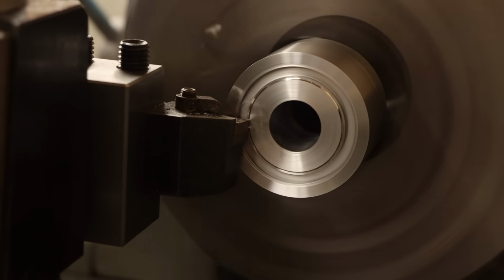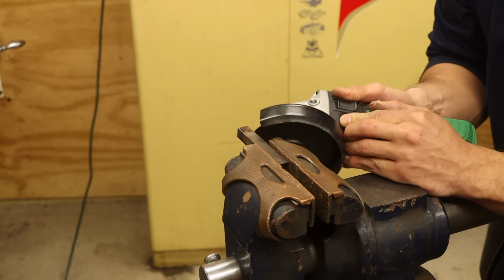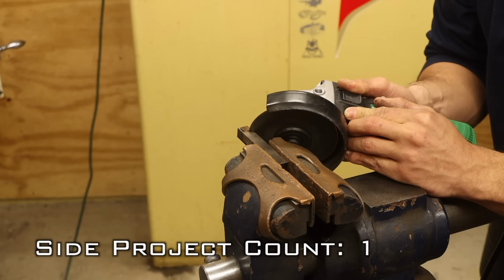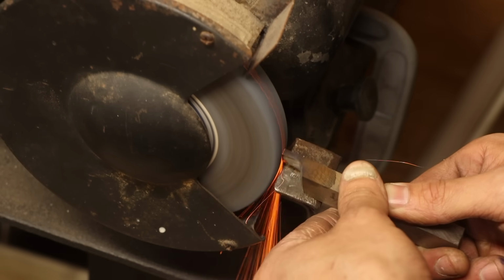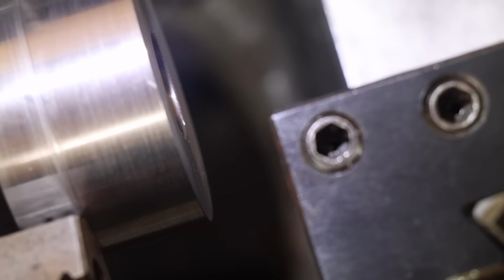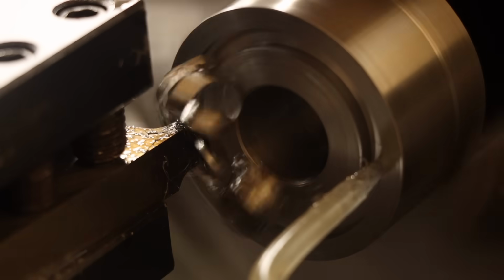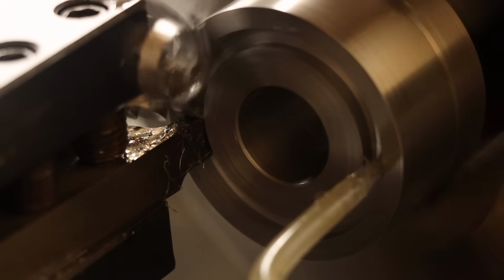But I still have the broken trepanning tool problem to address. So, I guess I'll have to just make a new one. Good as new. I'll get this squared up in a tool holder and I can try this once again. This time I'll do all the feeding by hand and properly lather this thing up in cutting oil.